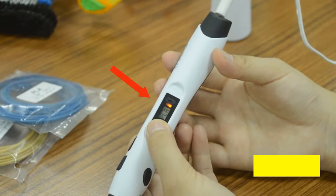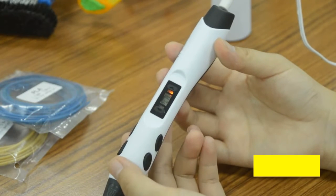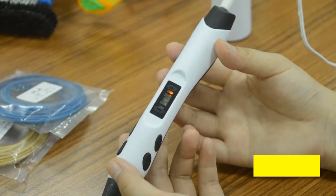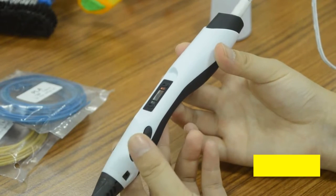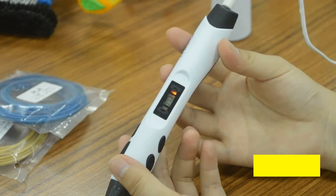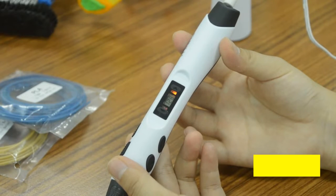Press the material temperature button to choose the material. It must be the material actually used, to avoid potential breakdown. After selecting the material, press the feeding button. When the LED light is red, it indicates entering preheating mode, in which the LED screen displays the real-time heating temperature.